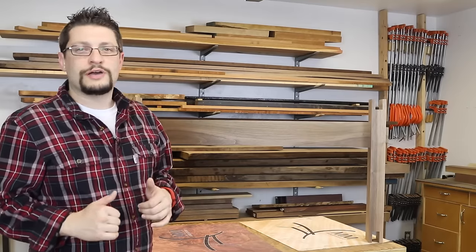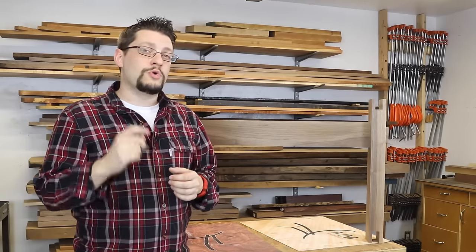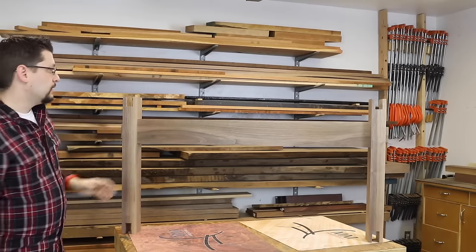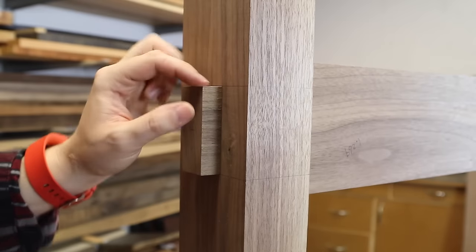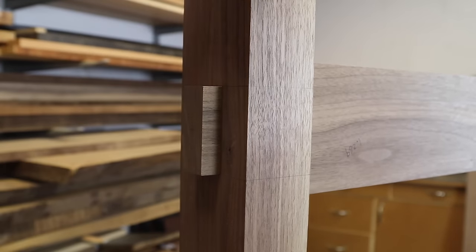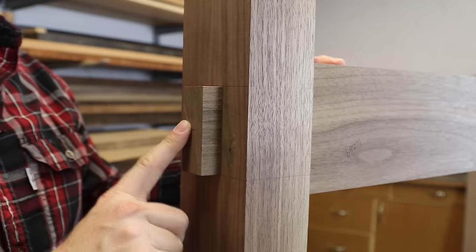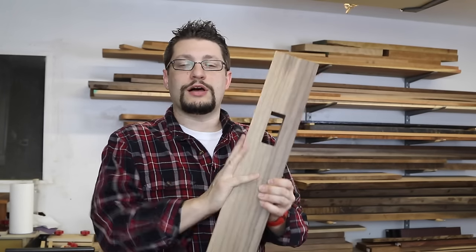Matthew Morris, M.M. Wood Studio, and this is an excerpt from the Nakashima-inspired dining table build. In this video, I'm going to show you how I approach cutting really large through mortises. Right here, you can see the trestle assembly. This trestle is five inches tall and its mortise is three inches tall, an inch and a quarter wide, and two and five eighths of an inch deep to accommodate this really large through tenon. Check out how I cut this large through tenon on this big post.